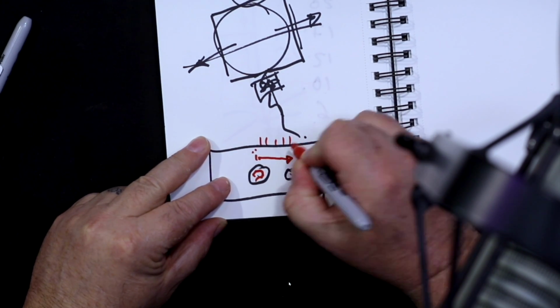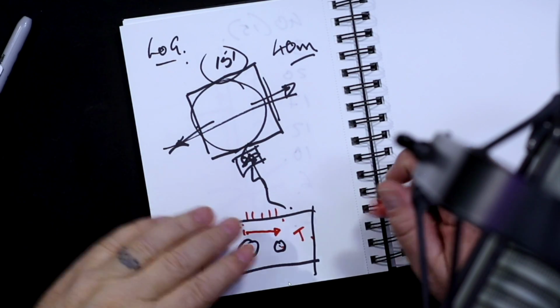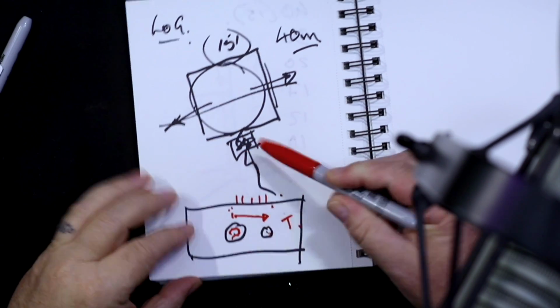And that often means that on the back of the radio, on an FT1000MP, you had a number of sockets, SO239s. You can put your main transmit antenna through your amplifier into your regular SO239. And then you could take one of these and put it into a different SO239. So you can have on your left ear your transmit antenna, let's say, and your right ear, you could have a receive antenna on exactly the same frequency.